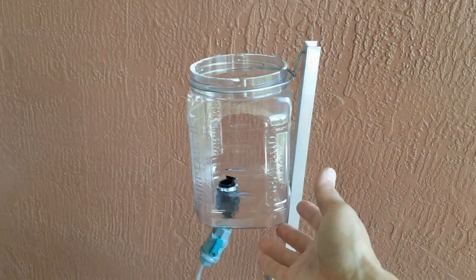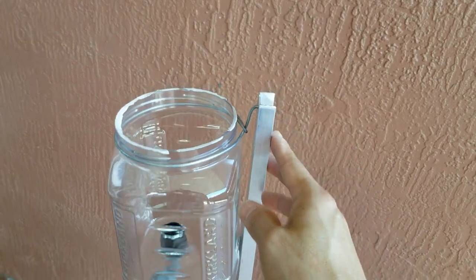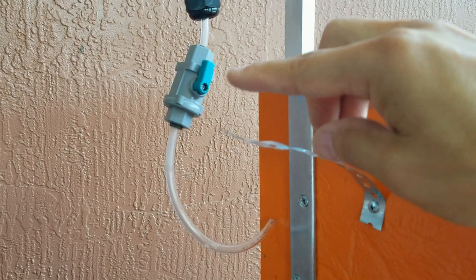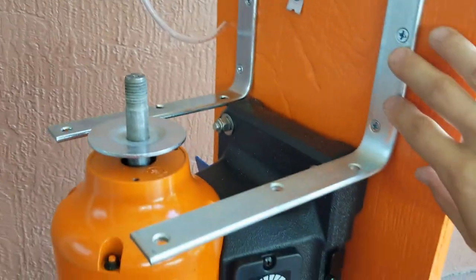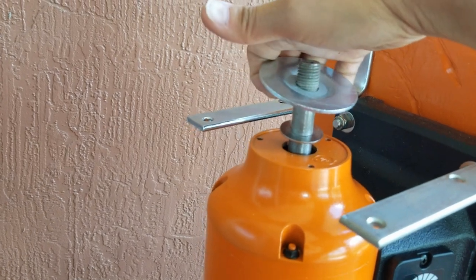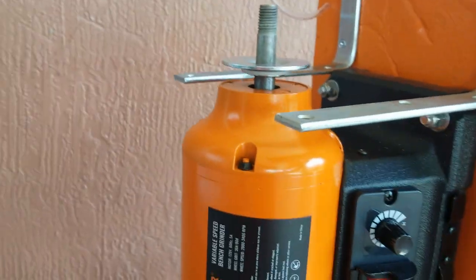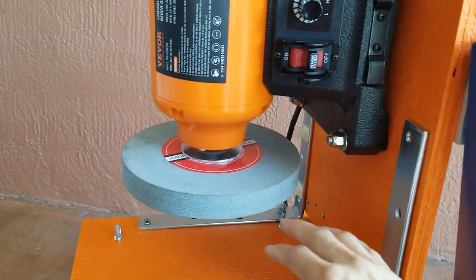Here's the one-minute tour. Got my basic water tank - metal wire just wrapped around the top, attached to a C-channel aluminum. Then there is the watertight gland with the drip line going into the flow control valve. This is the tubing into the drip line and the drip pan. Right angle braces. For the top part I did add a small 5/8-inch diameter washer and then a nylon washer to raise up the whole disc platform. A good old bench grinder with the potentiometer variable speed.